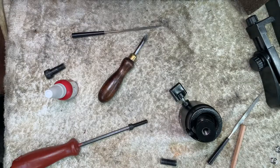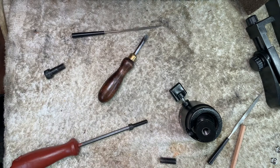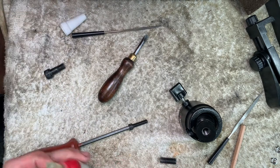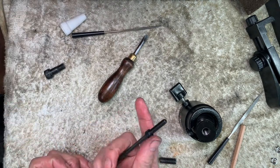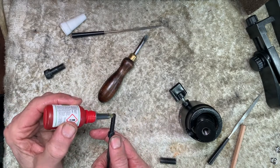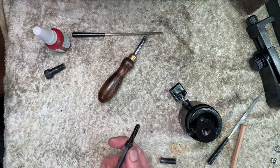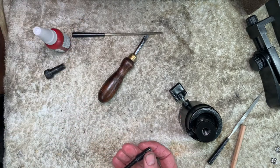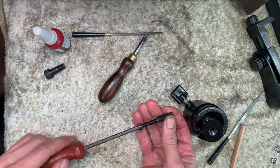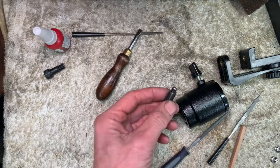Right, so we've drilled it and put a 1/4-20 tap in. As we all know, the sole purpose in life of a 1/4-inch Whitworth tap is to try and snap on you. Anyway, it didn't. Happy days. So I'm going to just glue this stud in, a little bit of thread locker, then we'll cut the cap off this to length. Yep, that's got it.